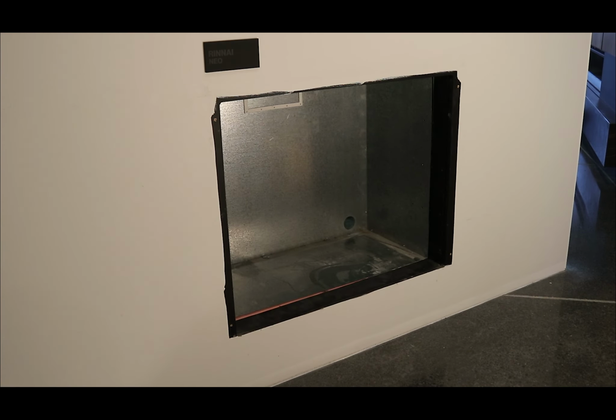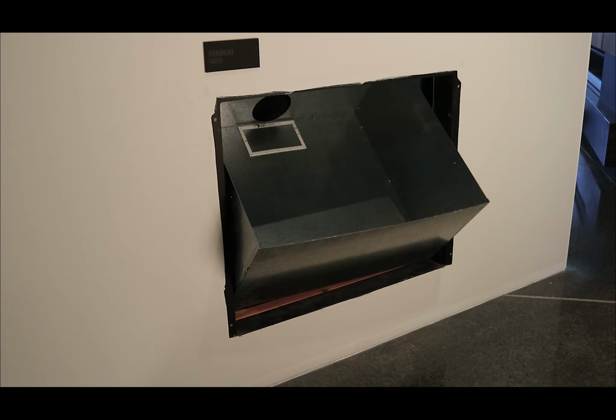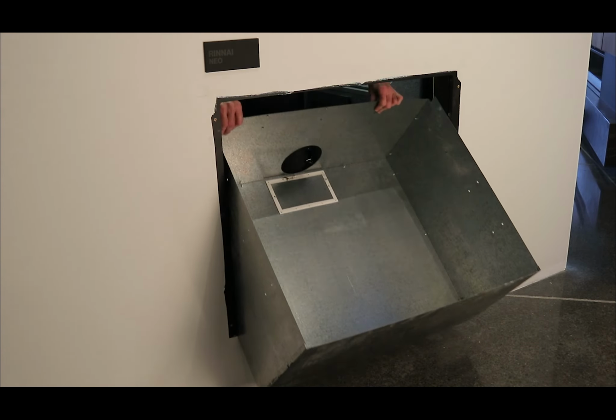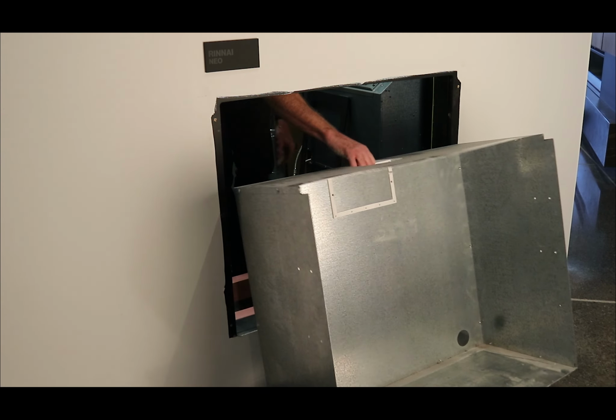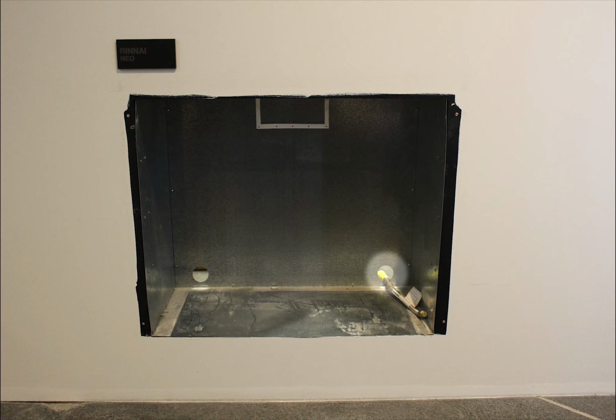Depending on how the wall has been lined, you may need to either tip the zero clearance box on its back to slide it out, or, if pressed for room, trim the opening to a maximum of 655 mm. This will allow for the old and new box to slide straight out and in, and still have the fascia cover the hole. The gas supply and power connections are in exactly the same place, so there should be no need to move any of the services.